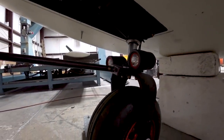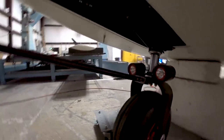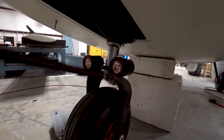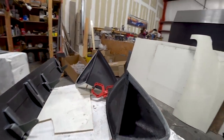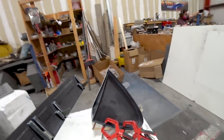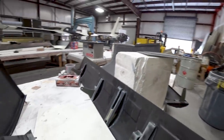This is how it fits on that little tow pin on the front of the gear. I can't really do much with it right now because the aircraft is on blocks and the nose gear locks into place when fully extended — it's always pointing forward. It's not until it gets some weight on it that it can actually turn left and right. Jeff's been bonding things together — these are the little extensions for the strake doors, with the inner ribs bonded into the outer shell.